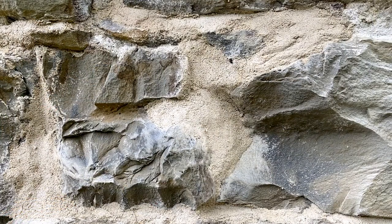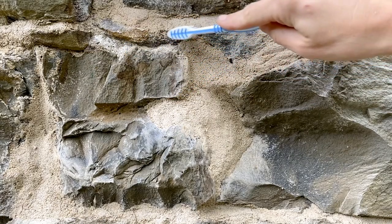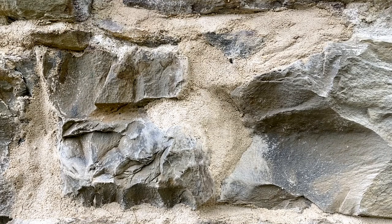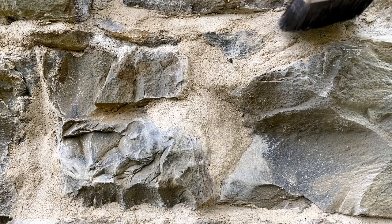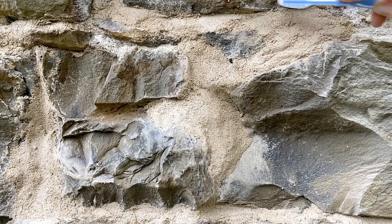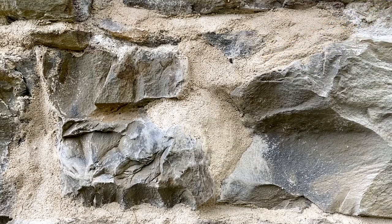My mortar's been drying for about an hour and I'm going to come through and kind of fine-tune the look that I want here. This is when I can actually use a brush or whatever to take away any really strong tool marks. It's still somewhat fragile but it's definitely not wet — it's dry and kind of crumbly on the outside — and I'm just carefully making some changes to the way I want my mortar to look once it's fully dry.